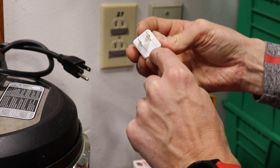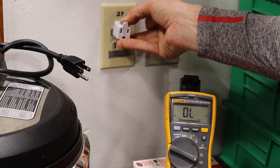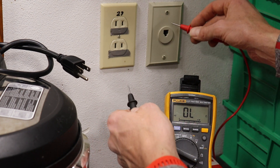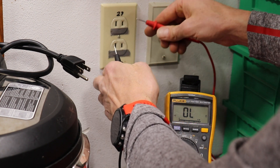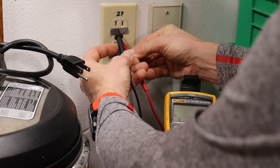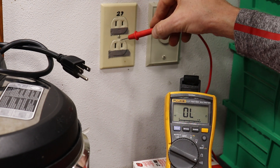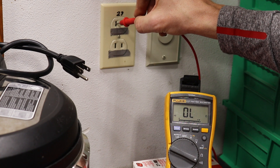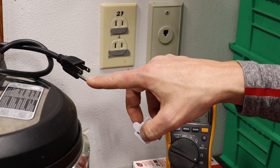If you read the instructions — which are typically printed on the body or come with it — it instructs you to remove this screw, place this in, and then insert the screw back into the cover. What that can allow in most outlets — and you really need to check this — is there is continuity between the screw which screws into the electrical outlet and that neutral. If I take my electrical meter and check the screw to the neutral, you can hear that beep going off, telling us we have electrical continuity between that screw and that neutral. In essence, I'm trying to achieve the same safety result by using the screw and the bonding of the neutral with this device.